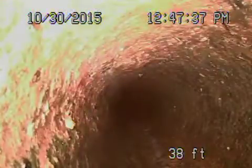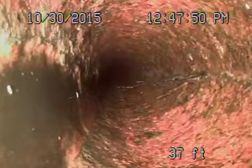Right here you can see there is a little bit of a crack in the line at the top, with a little bit of roots coming in through the top. We located it just on the side of the garage — there's a tiny root coming through right there, approximately about 3½ feet deep. The pipe is cracked there, and we're going to recommend to repair that as well.